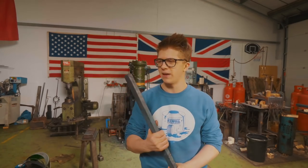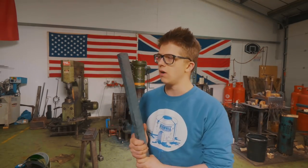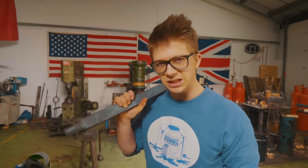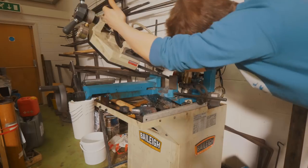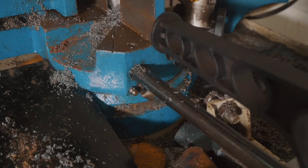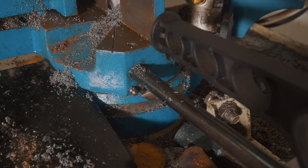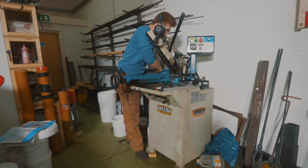Thank you guys so much for being here. First things first, this is going to be going into the bandsaw and I'm going to cut off the ends, and we're also probably going to have to cut it in the middle. So we're over here at the bandsaw. I'm going to loosen up this arm, and that's going to allow me to swivel the head and set an angle. You guys have seen me do both 33 degrees and 45 degrees for tiling the Damascus to get the pattern up to the surface. In this particular case, I'm going to stick right about 35 degrees, and I'm going to lock it off and put our material in the saw.